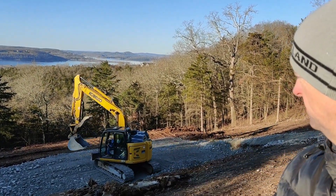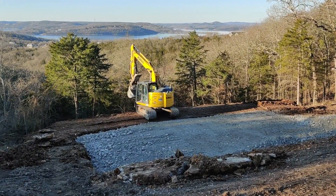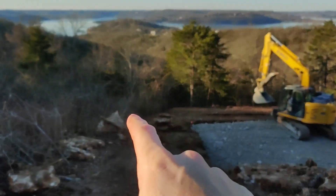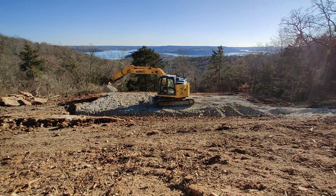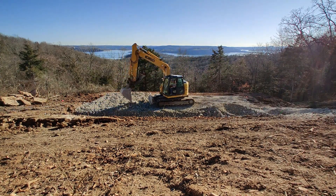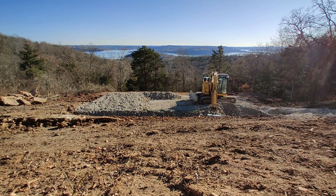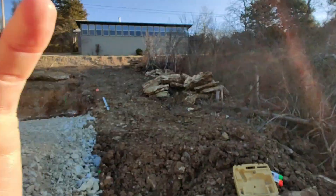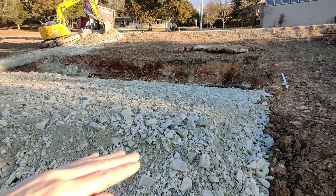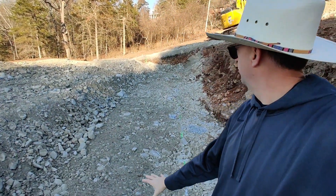Bobby is doing some compaction in here. Today is going to be a combination of things. We are going to take this rock here and start our stair steps down below in between our loads of backfill. We've got a laser level out and there's our final grade here. This is where we're going to have the different gravel, which is the one inch.